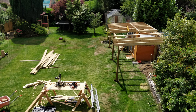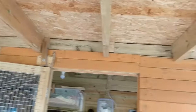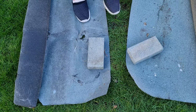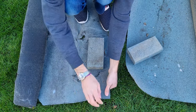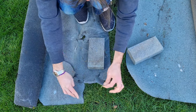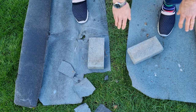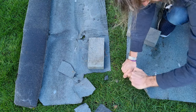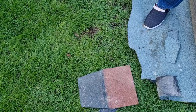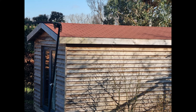With the roof joists in place, we fit the roof boards on top. This is OSB3, 8x4 panels, 12mm thick. Then on top of the board we put the felting. Don't be tempted to cheap out and use standard shed felt — it's barely fit for any purpose and will fail in no time. We want this enclosure to last. On the left we have cheap shed felt and on the right is a premium glass fibre reinforced felt. The cheap felt is much thinner and tears easily, whereas the fibre reinforced felt is much thicker and very tough. Felt shingles would have been another option but they need a steeper pitch than we've built.